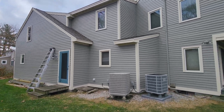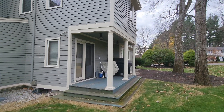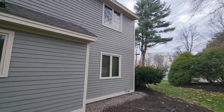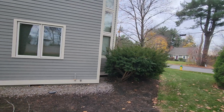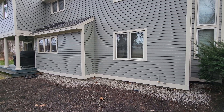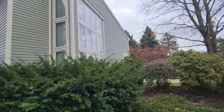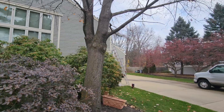Don't roll trim — just don't do it. I'm just about done painting all the trim. I went around and filled in about seven thousand nail holes that the previous two painters decided not to fill — doing that makes the house look a lot more finished. As you recall, this house had a lot of peeling due to the previous painter not priming the old stained clapboard before painting. You always prime exposed wood before painting exterior, or you'll have serious peeling issues. Even the areas I fixed are probably going to hold, but all the areas I didn't touch are going to peel over time.